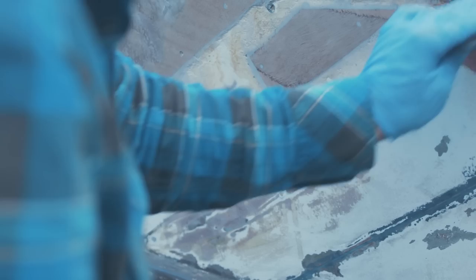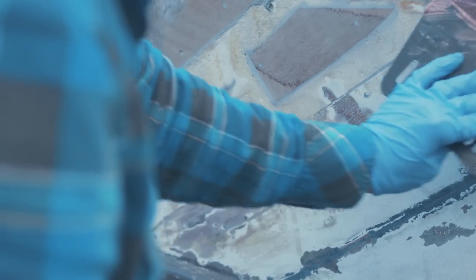So what's recommended with using the low density filler is to mix that into your epoxy until it becomes like a peanut butter consistency. And that's what works great, especially for fairing or applying to vertical surfaces like the hull. In fact, I probably could have gone a bit thicker here, but you have to add a lot of that stuff to get it built up. And I mean, it works great.